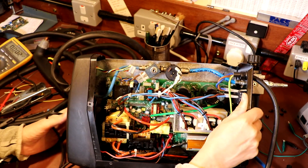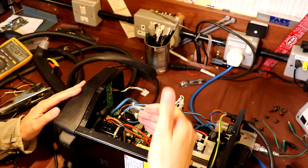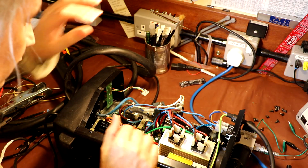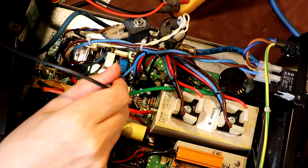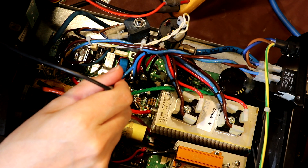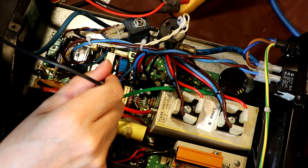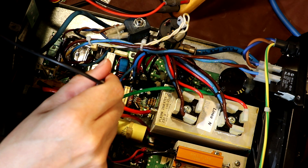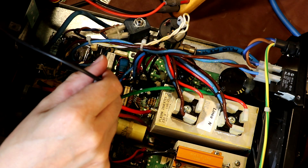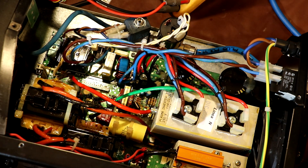It's quite an awkward thing to work on because of all the cables and the way it's assembled. Some things are mounted to the back plate and a lot of things are screwed through the PCB onto the back plate, so it's not really easy to get access. Here's the female part of our header connector and luckily it's got some labels on: zero volts, and a header called test SD, CA, CB, zero volts, K1, and then we've got 24 volts, zero volts, zero volts, minus 15, plus 15, and plus five. Let's switch it on and check the supply rails.